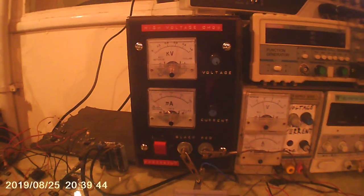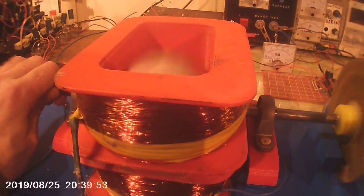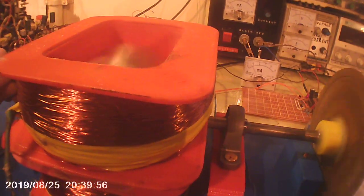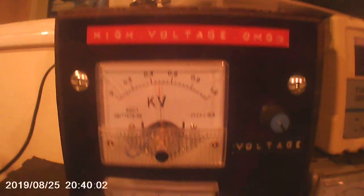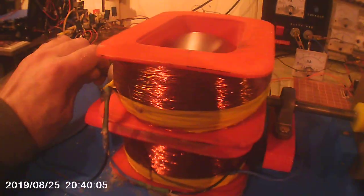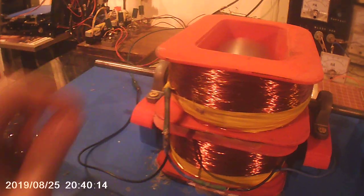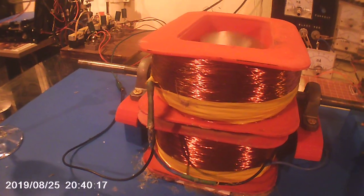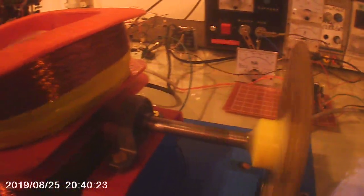This is the highest I've ever pushed it — about 730V. So what I'm going to do is put a heavy load on it and loosen it up a bit. That's really a very heavy load and it's jumped to 8mA and pulled the voltage down to 500V. That is quite a heavy load — if that shaft wasn't covered in epoxy resin and a shining agent that would have really burnt my hand, but as it stands it slides quite well. It just feels odd applying so much pressure with so few repercussions.